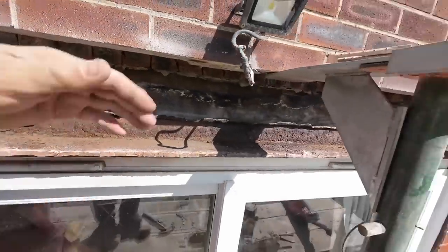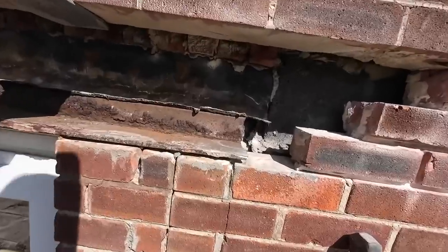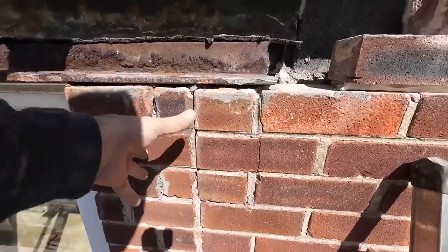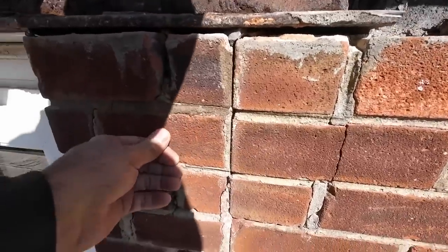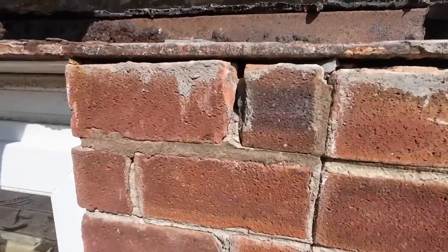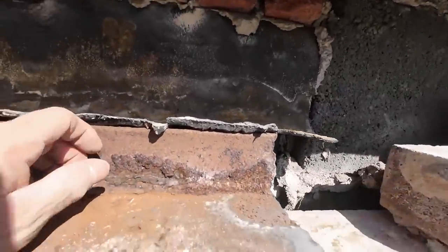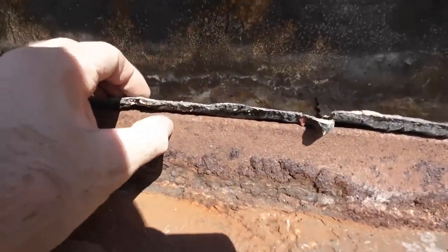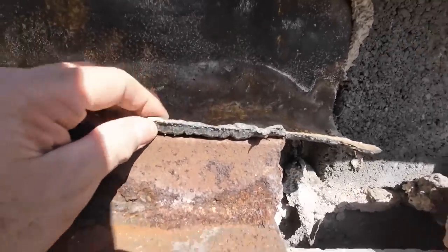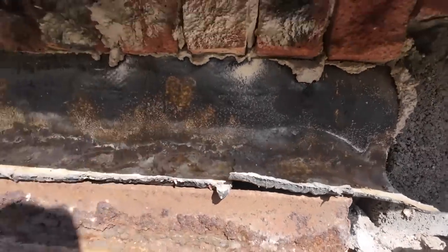Right, we're at the demolition part, 90% finished. Oh yeah, just got this bit to knock out now. Take that half out, take it down to there, build that back up so it's tied in. So it's actually attached to something. So, here's that nasty, nasty lintel. Well, there's the tray. Now this edge is gone because this was in the brickwork, but looking at that edge, it looks like that was never in the brickwork. But anyway, we haven't torn that. So far, so good.